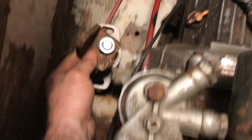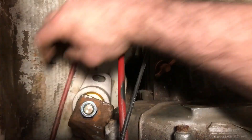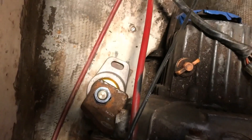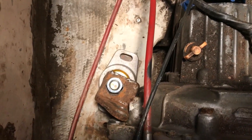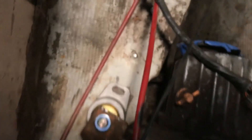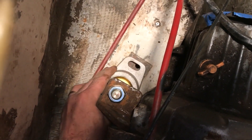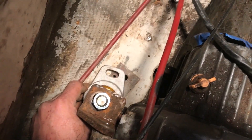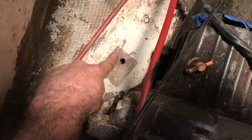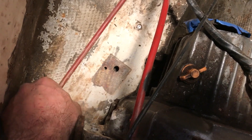I seem to have run into an issue with the positioning of the new engine mount. The original mount was placed at an odd angle — I wondered why. Also, the bolt pattern was different from the normal 1GM10 engine mounts, which isn't surprising because this is not the original engine. Someone probably had to cobble things together to fit it. The issue is that I needed to drill new holes, and when I went to drill this hole here, there's no way for me to access the nut underneath, and I might go through the hull.